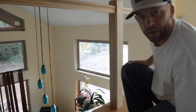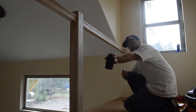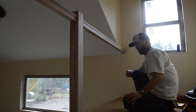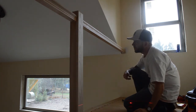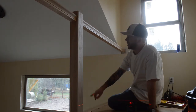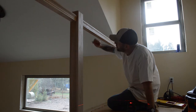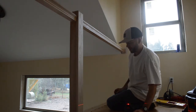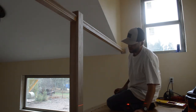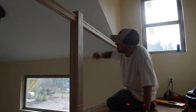Now to put in all the balusters we use our laser level. We point it and get it straight, and it shoots a plumb beam straight up, centered with the hole — straight up every time. It's self-leveling, so it balances itself automatically.